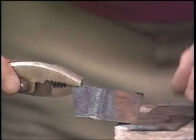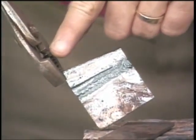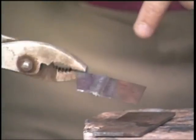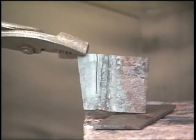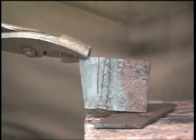What I want to show you right here, look just how thin. It's actually less than a hacksaw blade right there. So there's the front side. There's the back side. As long as you keep that tip down close to the metal, you can just about do away with any slag on the back. And that tip, where we cut on the outside there, is very smooth. A plasma cutter, which is a very nice piece of equipment, but also very expensive, will not give you any nicer cut, and that's just 4 pounds of oxyacetylene.